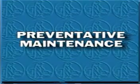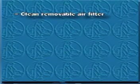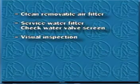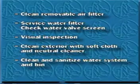The following preventative maintenance checks will help keep Hoshizaki KM Series Cubers dependable and serviceable for many years. Clean the removable air filter. Service the water filter and check the water valve screen. Visually inspect for loose wires, oil spots, water drips, etc. Clean the exterior with a soft cloth and neutral cleaner. Clean and sanitize the water system and bin.